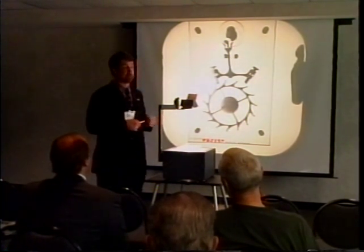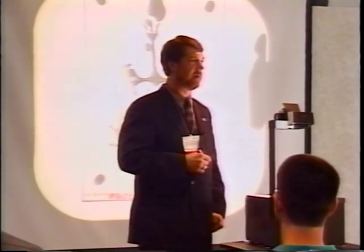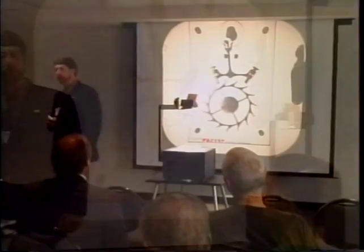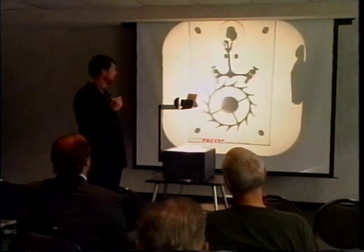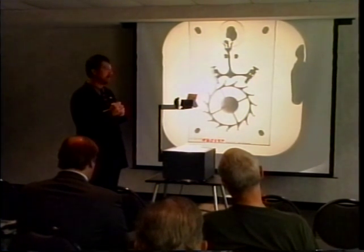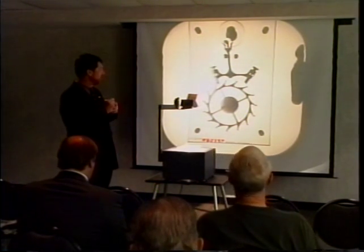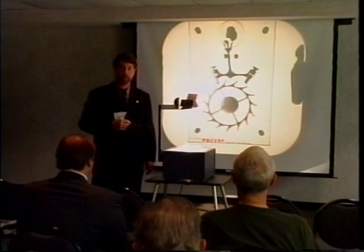Some of your high-grade watches, I've never been that lucky to work on a whole lot of them, might have less than the one-third total lock coming right out of the factory. Yeah, your high beat, I've noticed, have a lighter lock. The other thing is your escapement model is based on an 18,000 beat watch where, according to the textbooks, you have a 103 degree angle from your locking surface to impulse surface here and 115 on this side. But on your high beat, they all have the steep angle. These two jewels are basically interchangeable. They've got exactly the same impulse angle.